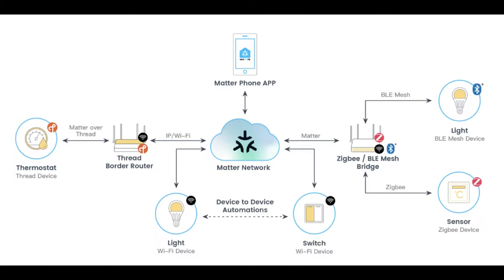You can pick and choose which protocol you want to use based on your application, and the device can change between different protocols. For example, if you are selling a device, you may want to use Zigbee because it offers the lowest power and lowest overhead — so longest battery life — but if the home it's being used in doesn't have a Zigbee router, you could fall back to Bluetooth or Wi-Fi. And because the chip supports Wi-Fi, BLE, and Zigbee, it can also act as a bridge, funneling Zigbee Matter devices to a Wi-Fi network.